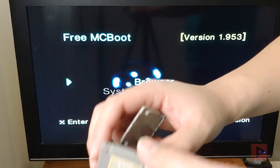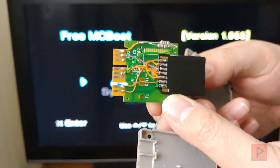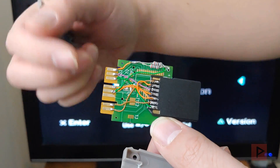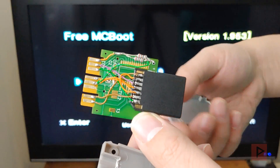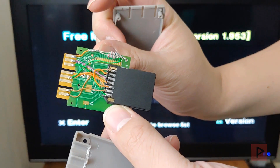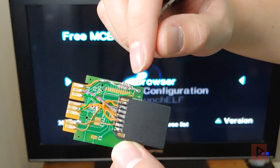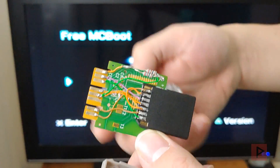Here's my memory card — I took the screws out ahead of time. I'll have a schematic online that I show. Technically you're supposed to use a 47 ohm resistor; I didn't have one so I used two 100 ohm resistors in parallel. I used jumper wires to go straight to the contacts on the memory card rather than solder resistors direct — I had a concern about lifting off the pads. If you're a pro at soldering, you could use a mini micro SD card holder or SMD chip resistors to make the project more compact. I didn't have that stuff so I'm going old school, and it worked out well.